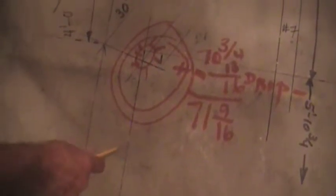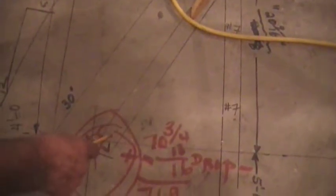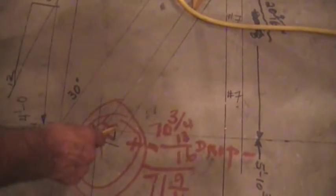These are the outside ribs, the back wall or the front wall. These ones are 3.5 inches, because that's your 2x4, and it comes around the top. This is part of the back wall, which has a 2x4 turned on its side so that you can have a nice wall in the back if you ever want to nail sheet rock on it and insulate it. Trying to make it nice.